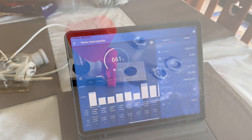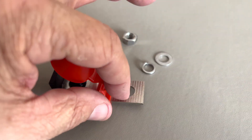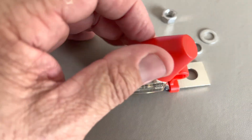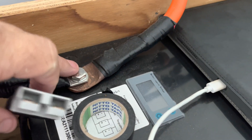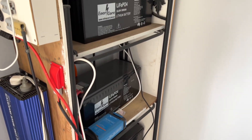Here's the fuse I fitted to my inverter. You bolt it down on your battery terminal — this is the 300-amp fuse. It simply goes on top and your inverter cable goes on here. All my positives are here and all the negatives are going through the shunt, which feeds off the post. This system has been running now for at least six months and it's been going very very well.